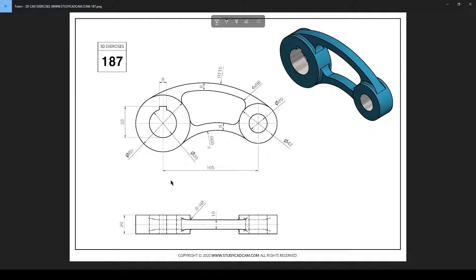Let's talk about how I would approach this. Most people would take this drawing, make a full sketch of everything, trim away things and make it look like the drawing. I will not do that. I will focus on the things I need first. We have some radii here, and a multiple of these I will do using the fillet tool. These two inner arcs are dimensioned to the outside, so I will use the offset tool for creating those.